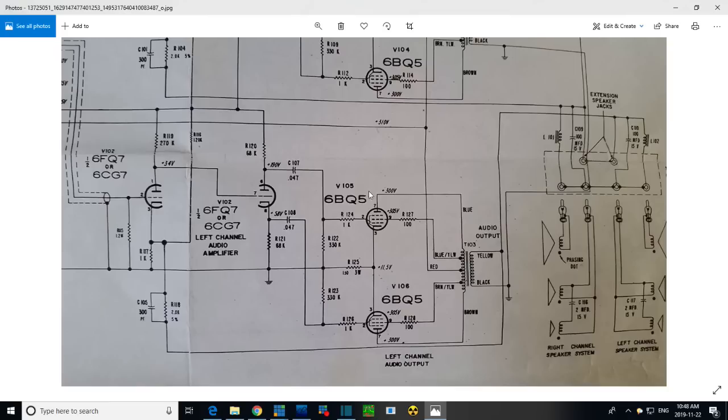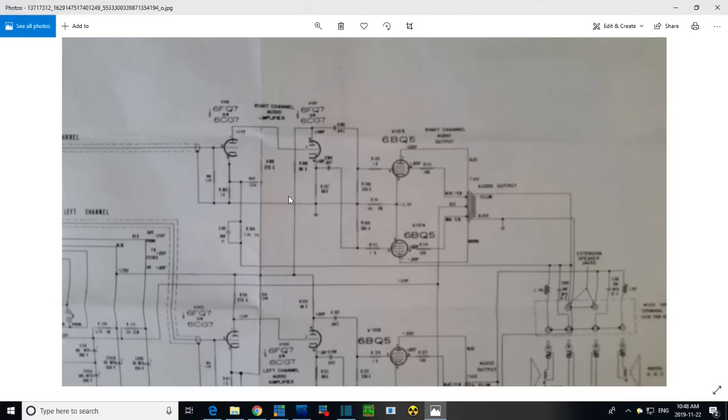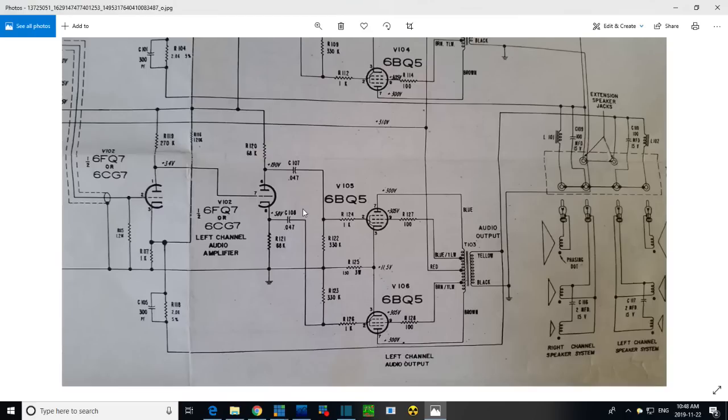Okay, I think I've got enough here in my head to go ahead and poke around. Let's just read the voltages here. 190 on the plate. Well, I'm going to have to refer back to this, but 190, 58, and 34. You can find them all on this half of the tube. Pin 6, pin 7, and pin 8. 6, 7, and 8. And we can compare each tube, because there's two of these. There's the other one up here, but this photograph is out of focus on this part. So okay, we'll try that.